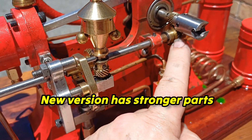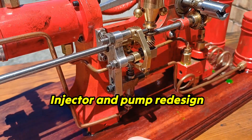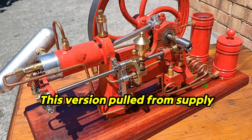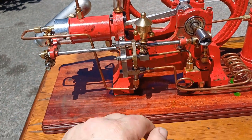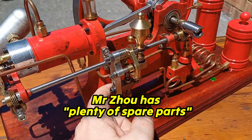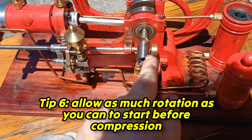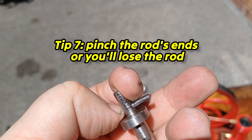He's redesigning this gear to be stronger and is looking at redesigning the injector and pump. For now, you'll still see it advertised by resellers but he says they have no stock and won't be shipping. If you've received one, as I have and as Darren has, it'll be a good machine to start building your skills — chasing down leaks, figuring out that you need to rotate this back and give it a head start. It's quite hard on the starter.